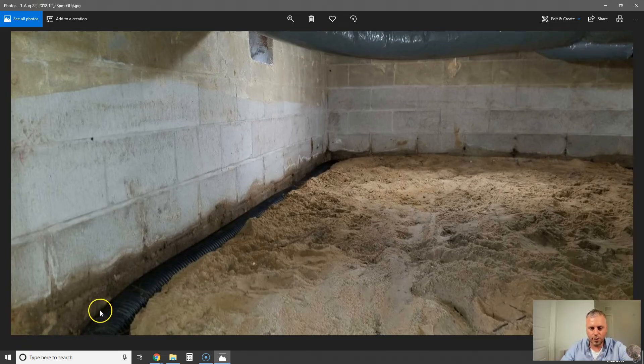All right, so we've covered drainage quite a bit, so here we go — we're going to explain what's going on. The water that comes into a crawl space, or a basement, but particularly we're speaking about crawl spaces, comes in from outside. It seeps into the soil, goes underneath the footer, and then rises back up around the footer.